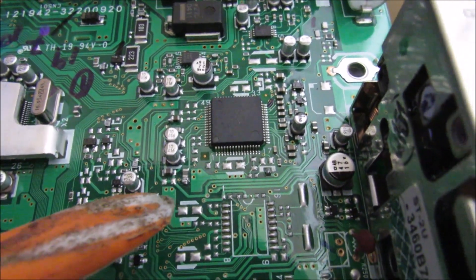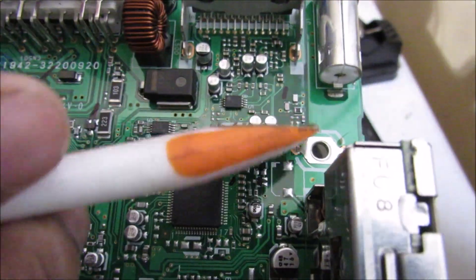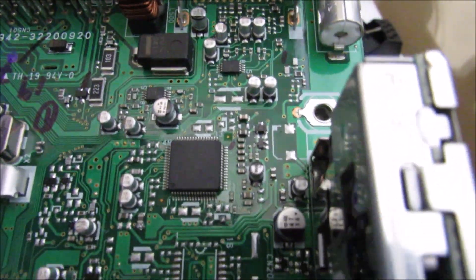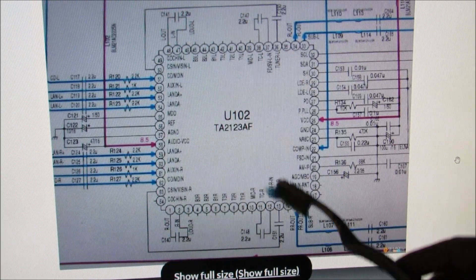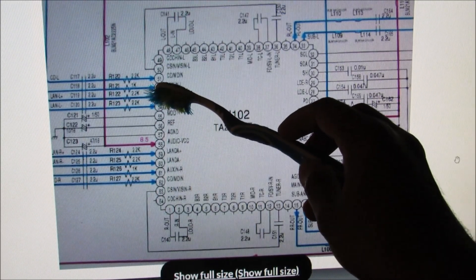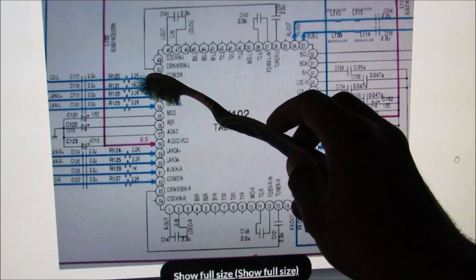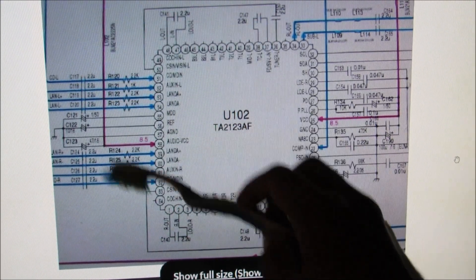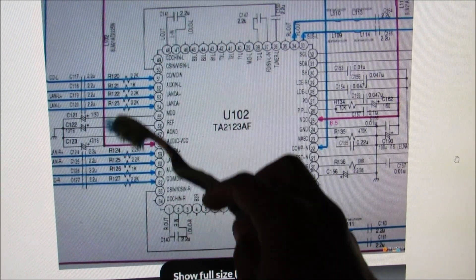That's where you're going to need to solder your two lines — left and right respectively. You'll also need to solder a ground wire; I found a point confirmed as ground using my continuity tester. Over here you can see there's a CD input on pin 51 and another on pin 62 representing your left and right channels, soldered in line to resistors. We're going to be adding our auxiliary lines in behind these resistors.